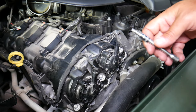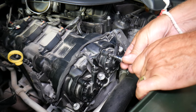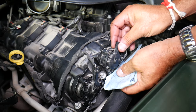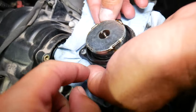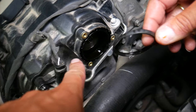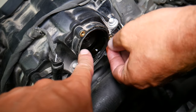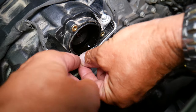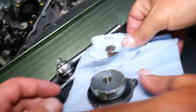There is one seal that will come out — we'll explain how to replace it. Put new seals in every time you remove them. Make sure you clean the canal and set the seal into the canal right here, otherwise you will not be able to install it. Just start pushing it in — it might be stretched a little bit or not flexible because of all the heat and age, so always replace them.